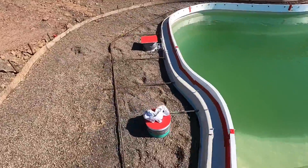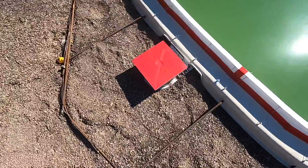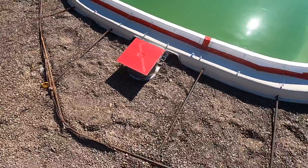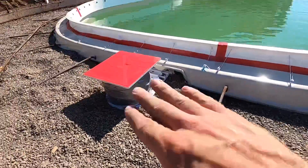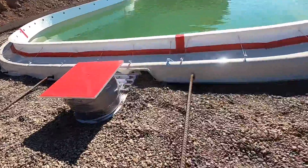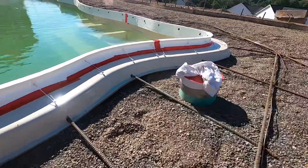Put a couple of extra ties around that. Tape anything like this. We have no handrails for this one. If you have a filter box, put your extension collars on it, set the height, duct tape it in place so it doesn't move, and tape the top of the lid — just keeping everything clean.